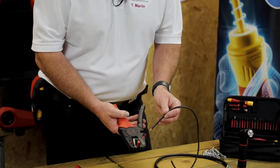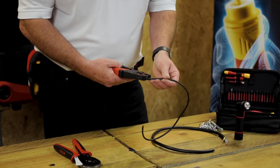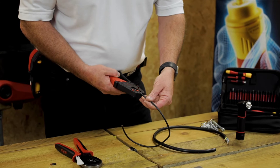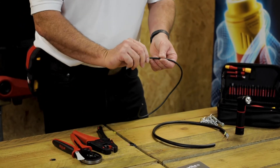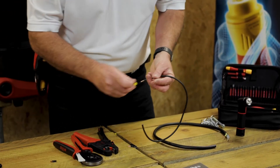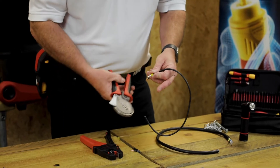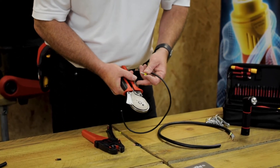So first with these, you get your wire strippers in, got your cable, adjust to where you want your cable sheath to come off, turn her over, get your ferrule, choose the ferrule you need. On this particular ferrule tool, it goes from 0.8 to 16mm, as you can see there.